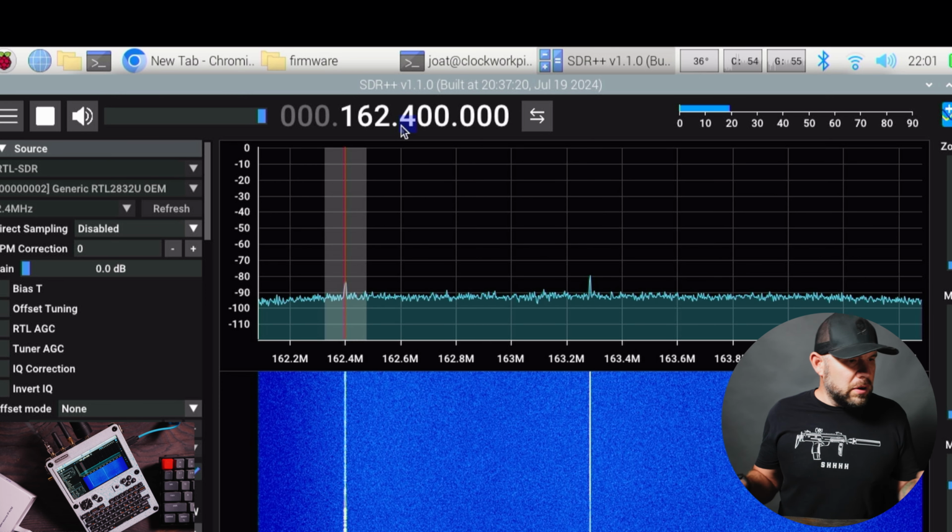So you can go ahead and add that enable_uart=1 to the boot firmware config file, and then just drop it down anywhere in the appropriate area for your chip. Again, just copy that enable_uart=1, and I can show you mine right here as I went ahead and threw mine in. Let me open up that file. Well, I can't yet. So if we say yes, get that going real quick, and then I can open that file once Minicom is done. So there it goes.